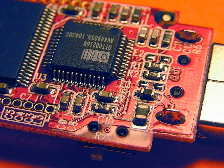Without expert skill, when manually soldering or desoldering a component, it is easy to accidentally reflow the solder of an adjacent SMT component and unintentionally displace it, something that is almost impossible to do with through-hole components. Many types of SMT component packages cannot be installed in sockets, which provide for easy installation or exchange of components to modify a circuit and easy replacement of failed components. Virtually all through-hole components can be socketed.